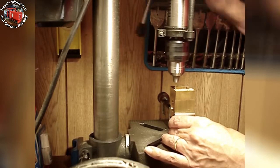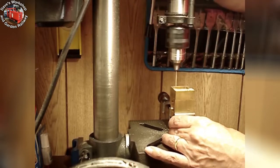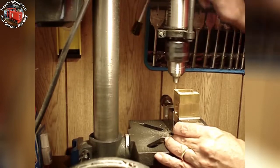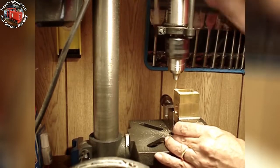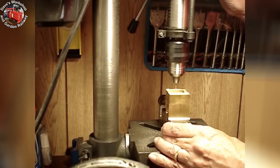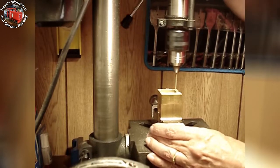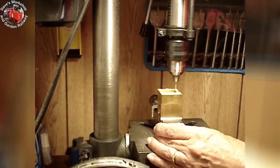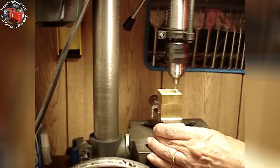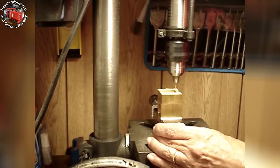The drill is spinning at 2,000 RPM. You can see me lining up the drill at the start of each new hole — it's all by feel and quite light. This sped-up view has an almost CNC feel to it; it's the closest I will get to actual CNC. I like to feel the cut. Brass is such a clean metal and the swarf is so inoffensive, unlike steel which blackens my fingers and gets stuck in them like thin splinters.